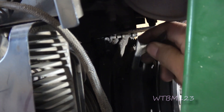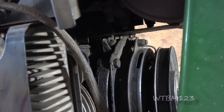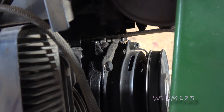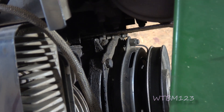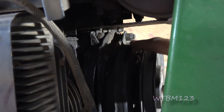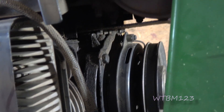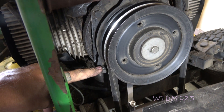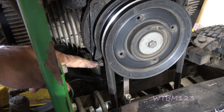Okay, now I tried over here. This side I can't get it in there at all — nine-thousandths will fit. I'll loosen these bolts on this side up a little bit and try to get it all to 18. Once you set one slot and go around, you've got to go around a couple times checking because it'll all kind of move a little bit on you. You want to make sure you get 18-thousandths everywhere. When you adjust these bolts, don't turn them very far because just a wee little bit makes a big difference.